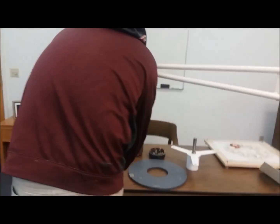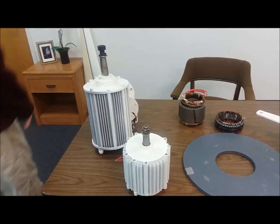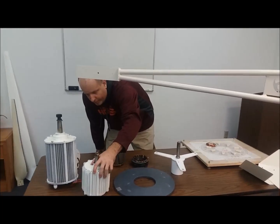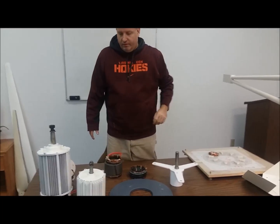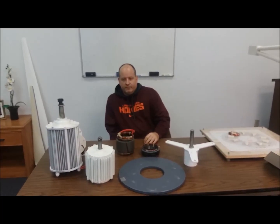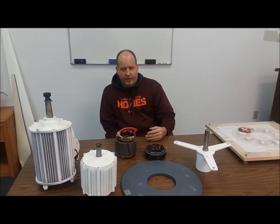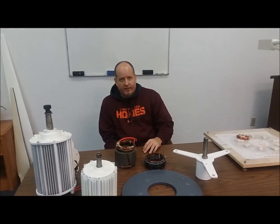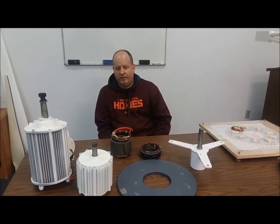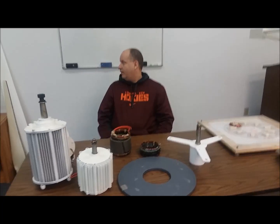We've got a tapered shaft on this alternator, which is my preferred method to keep the blades from flying off. Some of you may have seen videos on YouTube with people having problems with the shaft flying off PMAs. With the tapered shaft, once it is bolted down it's retained and it takes about a crowbar to get it off. A lot of you that are mechanics know how Morse taper works — that's the tapered shaft.